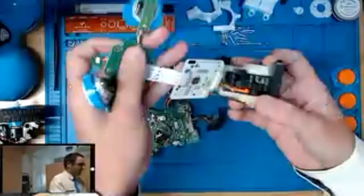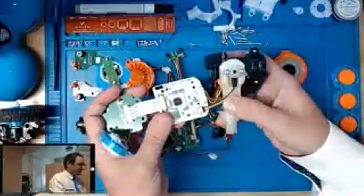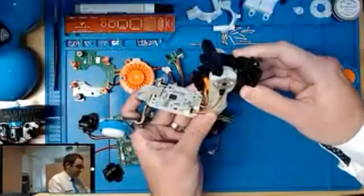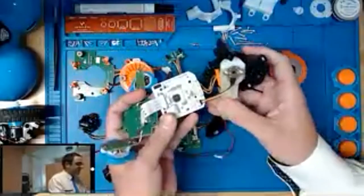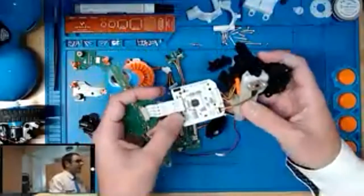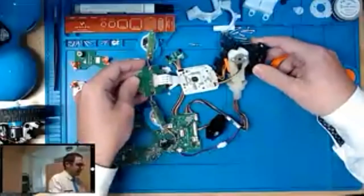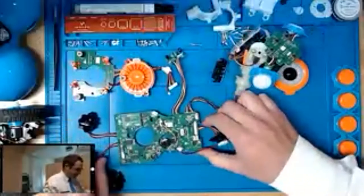On the backside of that board, we can see all the circuitry used to control those signals, as well as an additional potentiometer. These are basically variable resistors that are attached to the gearbox. And so in this case, as the motor moves and the head tilts up and down, the microcontroller and electronics are able to measure the current angle of the head. And so this way we're able to control, you know, if we tell Dash to look up, did Dash actually look up or how far did he move? And Francis and David will talk about how we can use that to create very accurate animations and other dance moves by Dash.